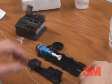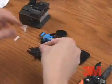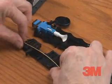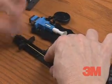Once the fiber has been cleaved, verify the length using the length gauge provided on the actuation tool. Next, lay the fiber into the grooves so that it extends beyond the funnel end. Close the covers and clamp.